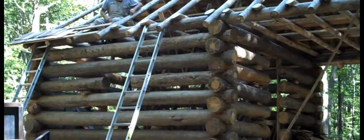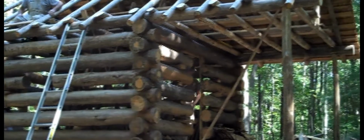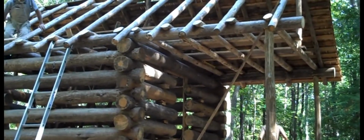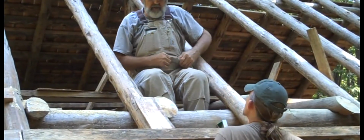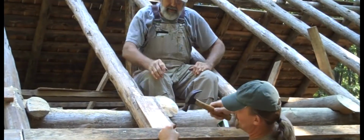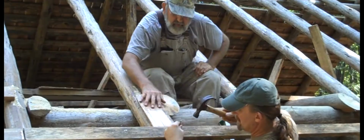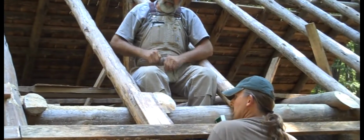The first lath will be extended all the way across on the very ends of these rafters, and then everything going up above will be measured to that. Mother Nature being Mother Nature, all these rafters did not grow with the same curves, same crooks, and sags at the same place. So shims are required to even things out, so that when those shingles are put across there, they won't sag.